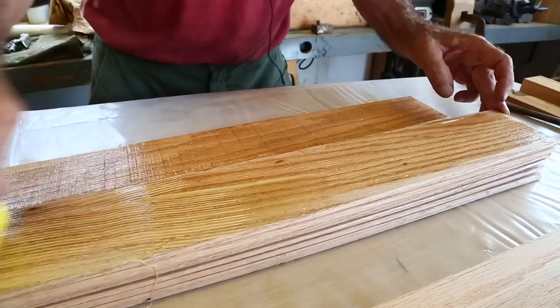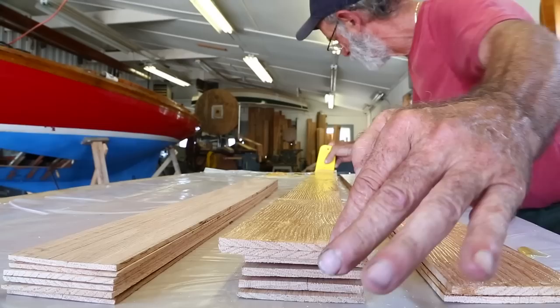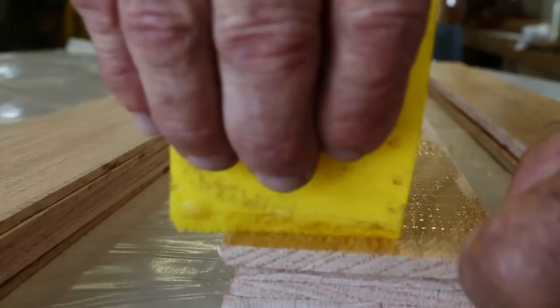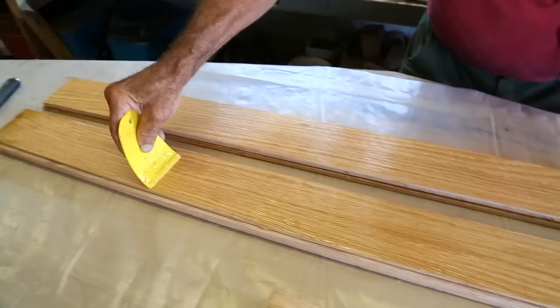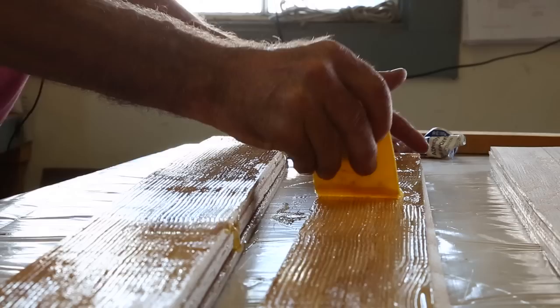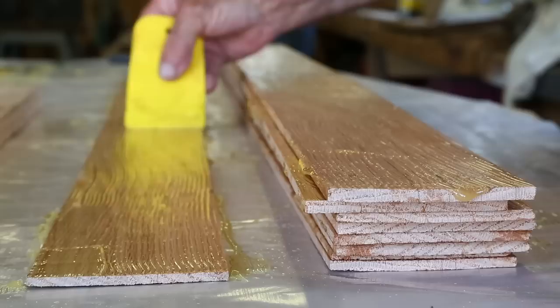It's quite quick, and that's one of the things you really have to concentrate on — getting it done. We just want to get it done efficiently. We developed a method that gets it on there properly without getting it on the edges, and meters it out exactly right. I've spread more glue than I need on the surface so I can taxi along quickly with the trowel and pick up the excess, then transfer that excess onto the next laminate so I don't waste any time or material.